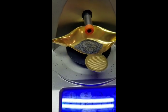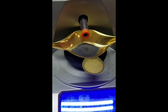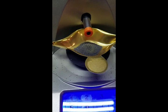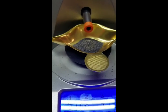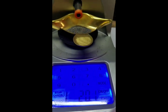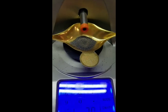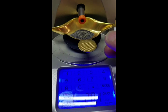The problem with this one is that it actually trickles a little too fast. At the very final trickles, it should slow down and just trickle, take a measurement, trickle, take a measurement — let the scale stabilize. It just seems like it's predicting when it should stop and stopping on the prediction. That's why it sometimes drops to 19.9.